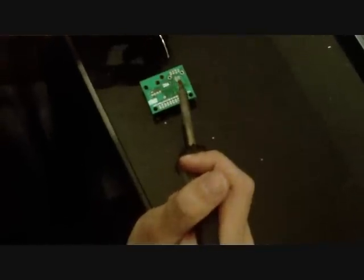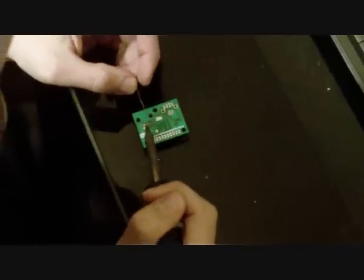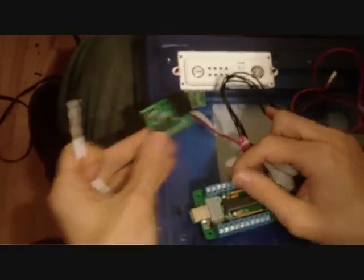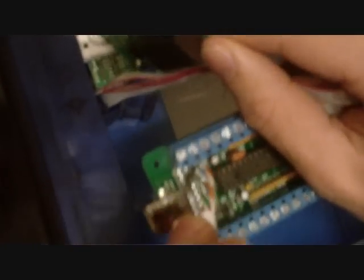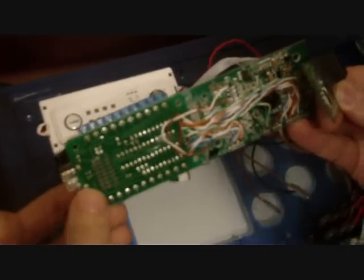The RJ45 jack is not soldered to the board, so we'll go ahead and solder the pins now. I'm going to be wiring up the imp version 2 to the MC Cthulhu. I'll be wiring up all those labels — GA through F and V. Xbox D-minus and D-plus will be soldered to the D-minus and D-plus for the USB on the Xbox.